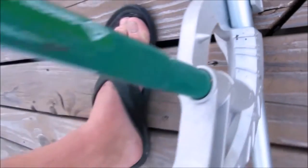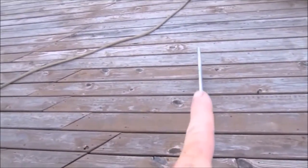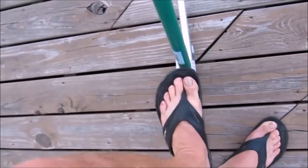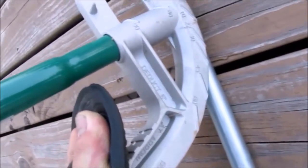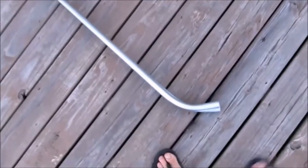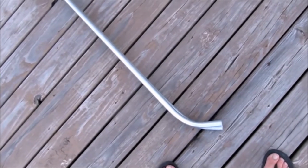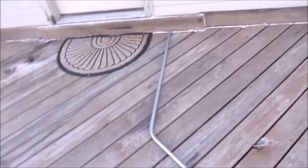I made a mark here, lined it up the same way, and you can see the top of the bending tool is aligned with the tip I've already bent. Once we're sure those are lined up and the bends are in the same direction, I'll make this bend to get it about the same. You can see them lying on top of each other - that's to get the match. They're off just a shade but I can straighten that. This is the overall shape of the greenhouse - these two halves connected make a finished greenhouse rib.